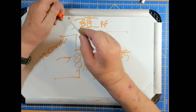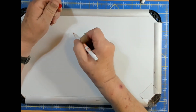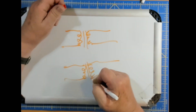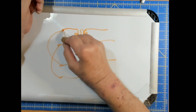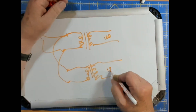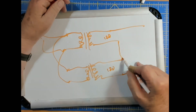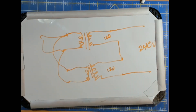So the idea is to isolate. Now, you can take two isolation transformers — one and two, each with a core — wire them so the outputs are in series. If they're one-to-one, you'll get 120 and 120. Note that it is isolated — you can wire the outputs together and have 240 volts out. Does that work? Yes, absolutely that works. Normally you would buy a single transformer that would do that job.